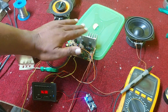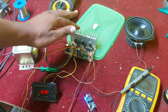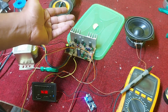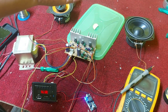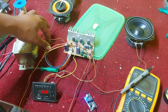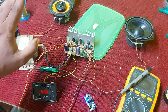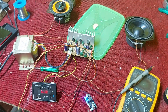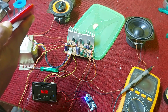This board definitely gives more heat, so you must use a proper heatsink. You can build a small cabinet of your own, or use this as an inbuilt active speaker system — it works very well for that. The board costs only 250 to 350 rupees depending on the PCB and component quality.